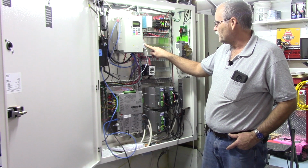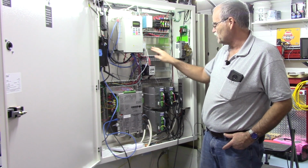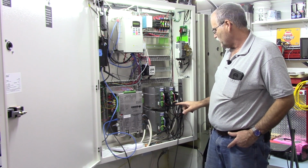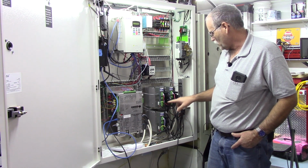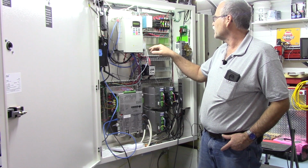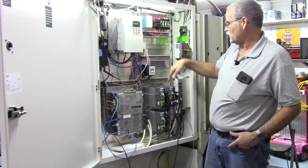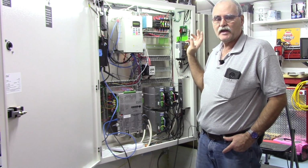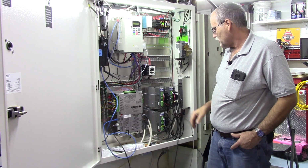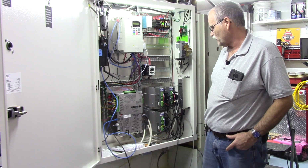Off that line filter there are 3 sets of wires. They're not daisy chained, they're paralleled here at the filter, they come down and feed the logic power, which is L1 and L2 on these DYN4 drives. That in turn is being fed by a pair of fuses, and the logic power comes on when the control cabinet is powered up, just like Oak. So it's ready to go, and Oak can start talking to the DYN4 drives.